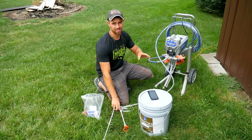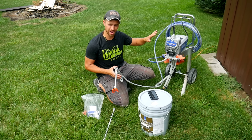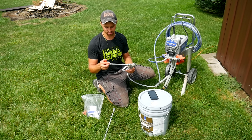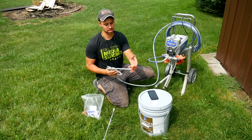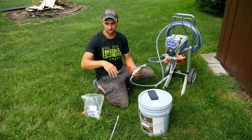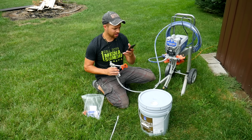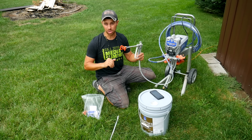It is time to bring out the big guns. I've got seven gallons of Sherwin-Williams Super Paint and I'm going to use my Graco Pro X17. I really don't think a brush or roller is the way to go on metal — if you have a project like this I'd highly recommend renting or borrowing an airless sprayer. Check with your local home centers, rental centers, and paint stores. I'm going to use a shorter wand so I have a wide range of reach but stay consistent distance from the wall. I'm using a 515 tip, which gives me a 10-inch fan pattern when I'm about a foot away — which is what I'm after.